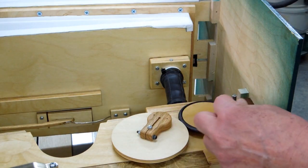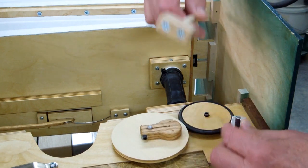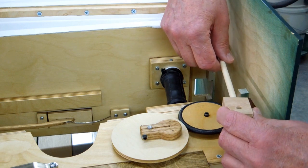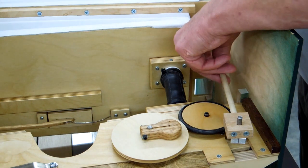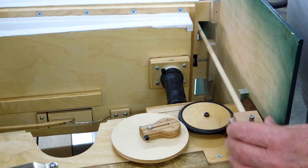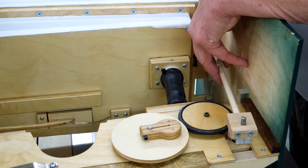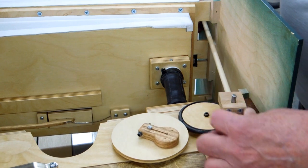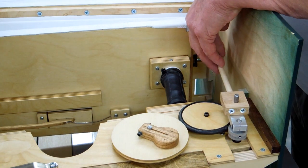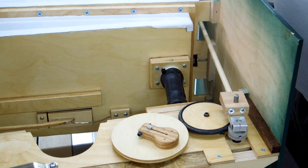The throw on this crankshaft is two inches — one up, one down. I take my connecting rod here and this one will just slide on over the end. I get that at top dead center and make a mark on the end of this wood dowel. That shouldn't quite collapse the bellows. Then I go to bottom dead center, and that shouldn't quite be full extension on the bellows. You take that mark, cut that wood dowel to that length, and then try it again.